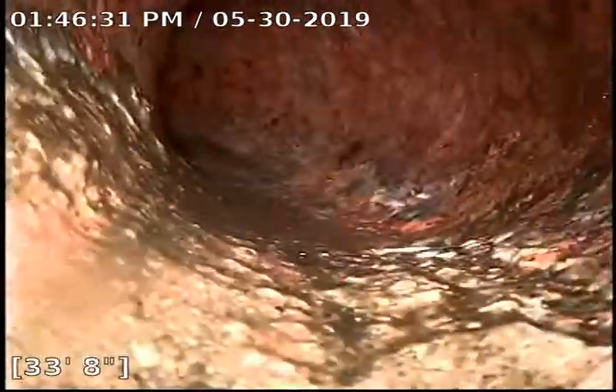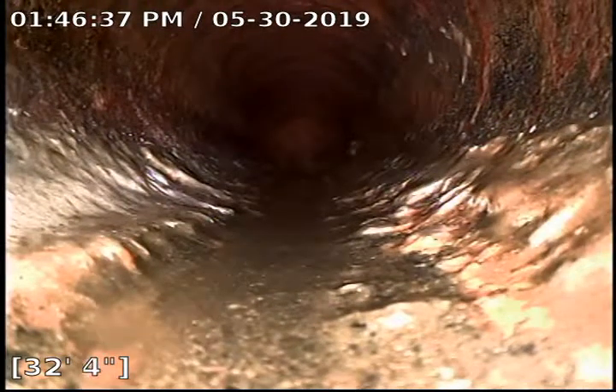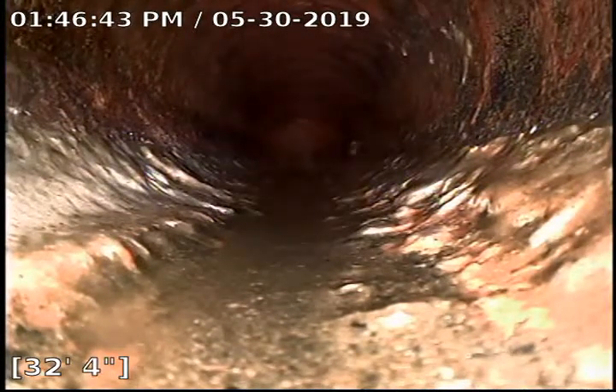I'm going to make another little turn right there. Looks like we've transitioned to cast iron, so we could possibly be right where the new addition starts with the old house. Pipe appears to be in pretty good shape. There is a little bit of standing water here, but not a lot, so it doesn't worry me. I do believe solids will flow through that.